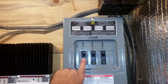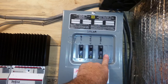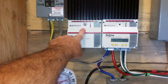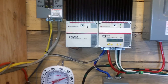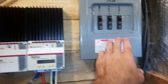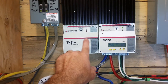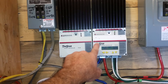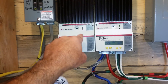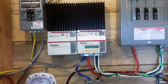By doing it this way, all of these are on one bus, so I can add three more breakers on the other bus and carry another circuit over to this other charge controller when I add solar. I'll move this over and give it a little more air space — it's just sitting there for storage right now, not connected. There's a data cable on the back of this meter; I'll run it over and plug it into the processor on the other one, and then this will just match whatever the first one's doing — so it's like one big charge controller.